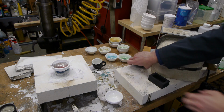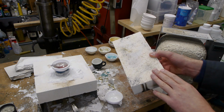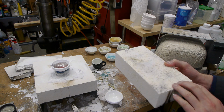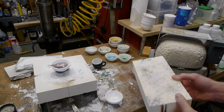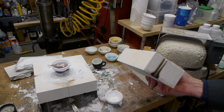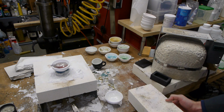So you can buy these fire bricks that are very lightweight and can take very high temperatures and are also insulating. I'll put links to all this. If you search for fire brick, be careful, because some fire bricks are rated for high temperature, but they aren't really insulating. It can withstand fire, but it's going to get hot on the other side. Whereas with a brick like this, it could be 1400 degrees C on this side, and you could put your hand on this side and it would be no problem. So to repair this kiln, I just put two of these standard size insulating fire bricks here, and that's now my kiln floor.